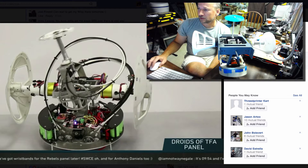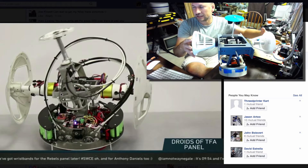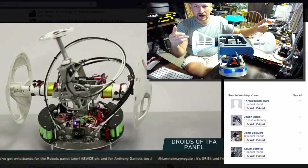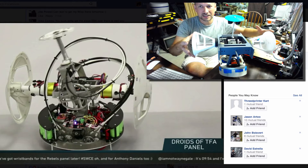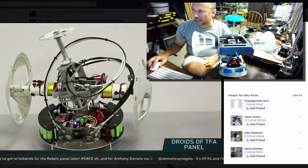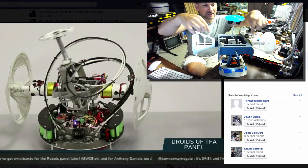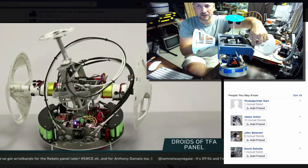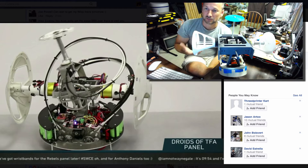What do the two have in common? Well, first off, you'll see the red carpet droid has a similar system — it doesn't quite have the triangles, but it uses extended hubs. The motors don't reach out and touch the sphere. Instead there's a hub, and the axles reach all the way in to the center where they're driven. In my case, I'm driving them right here from the first gimbal.